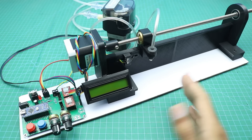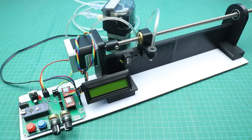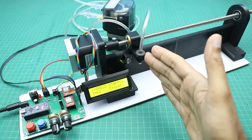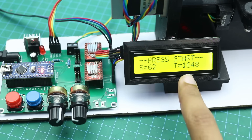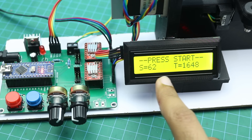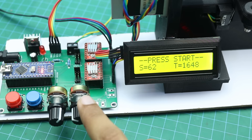I will do a dry run to show you the functions and working of the machine, and then put the bottle tray in and fill some liquid. The head automatically moves to the initial position. On the LCD you can see two values: speed and time. These two functions control the speed and filling time of the liquid pump using the potentiometers, so you can set any value for your desired filling amount.